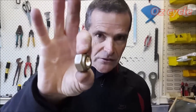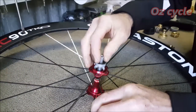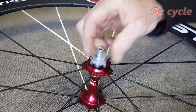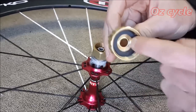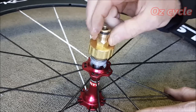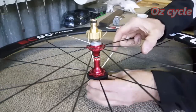You'll also need one of these — very common, get them in the plumbing section, and it's brass as well. Here's the axle and bearing. The next step is to put the special washer on — it fits exactly the same size as the bearing — then the brass bit goes on and the tap bit on top, leaving the rubber washer inside if you can. Get the large bushing with the thick side up underneath as a supporting block and tap it all together.